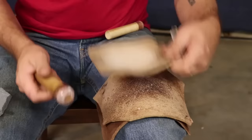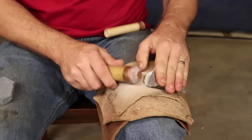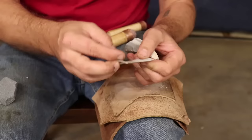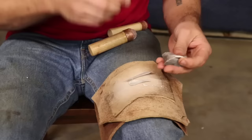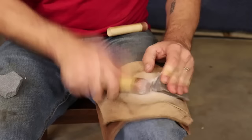Now, if we abrade that and knock off some of the little tiny micro flakes and really stiffen that edge, then we can take the bigger bopper, and now all of a sudden we can run these beautifully long flakes. So abrading, as much as it's not really fun, and you don't have to sit here and abrade for 3 hours before you take a hit. It's literally like, just knock the stuff off till nothing's coming off. And then you can take a pretty good hit and knock a nice flake.